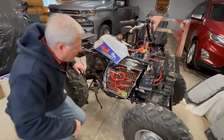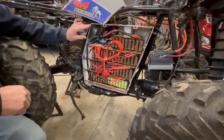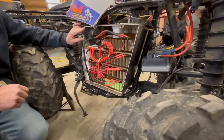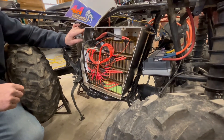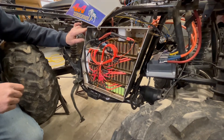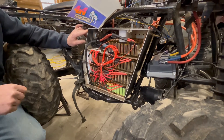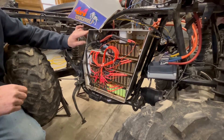First is the battery. It's in an aluminum enclosure that's vented to allow air to circulate through it. It's an 18S24P and about five and a half kilowatt hour capacity, so it's about half the size of the motorcycle and snowmobile batteries that you may have seen. I'll post online a detailed explanation of the battery, but for now I'll just give a high level explanation.